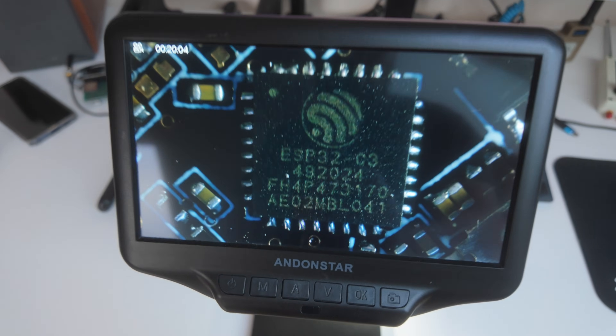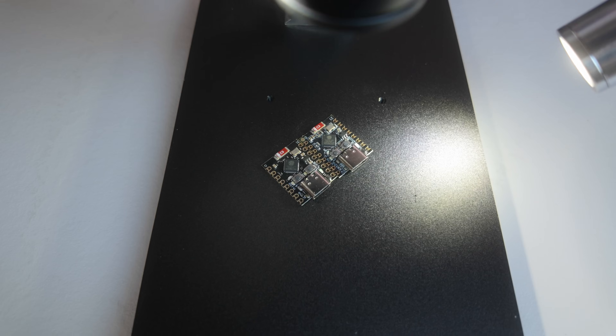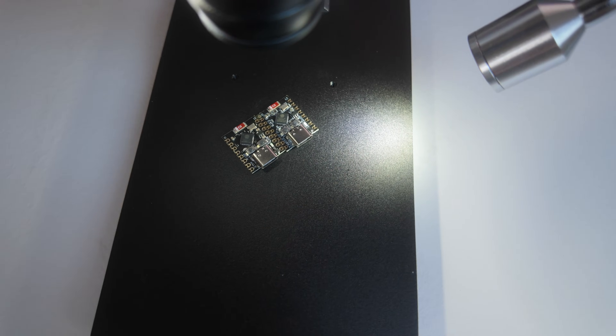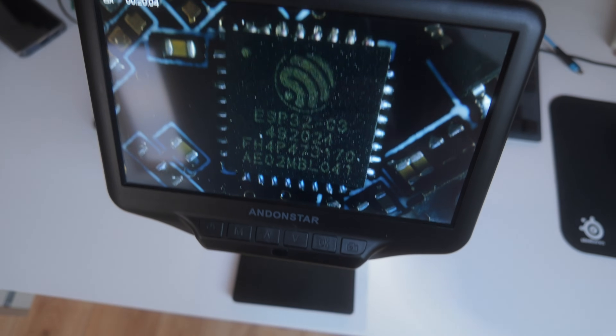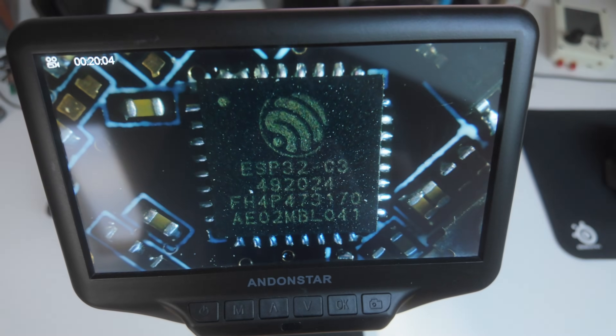What's the difference? The used microcontroller. One of the reasons that the ESP32C3 can be so cheap is that some versions come without flash memory. No flash memory means cheaper to manufacture, and the versions with and without flash memory from the outside look absolutely the same — same form factor, same layout. If you don't know what you are looking for, you have no chance of not getting screwed.